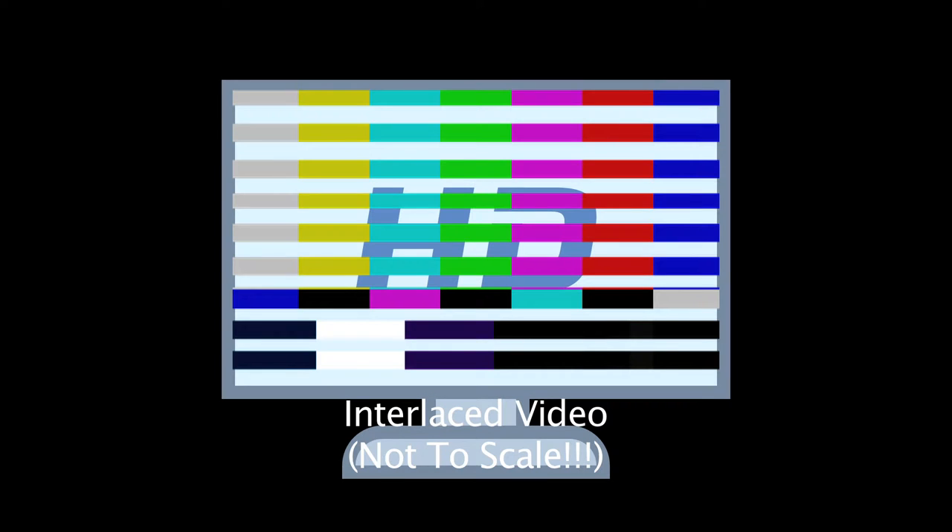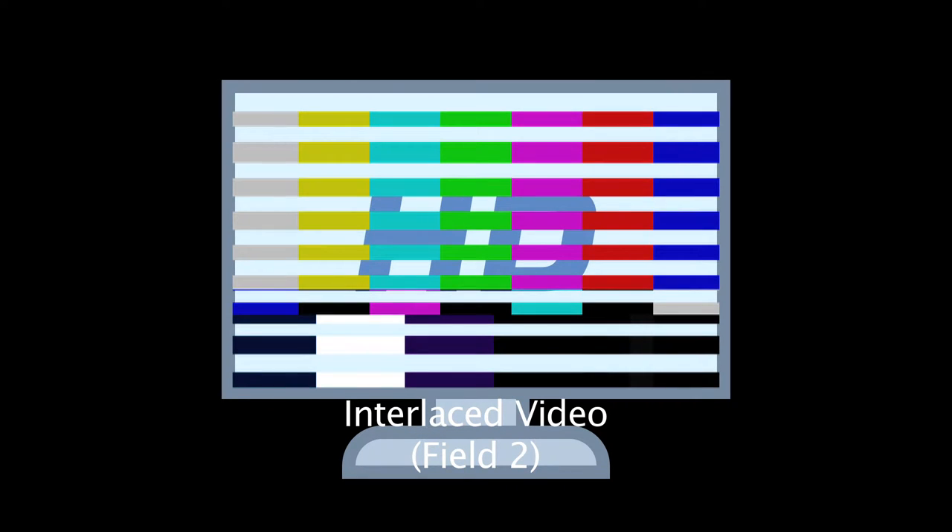The signal your television displays is either interlaced — comprised of two separate fields — or progressive, which is a single field. Interlaced video signals use two fields to create one single frame; the purpose is to save bandwidth during the actual broadcast. Progressive video is comprised of a single frame broadcast at once. While both types of video signals use a line-by-line refresh, the speed at which HDTVs refresh — even for an interlaced signal — is too fast for the light sensor in the Zapper. Regardless of your region, console, or light gun, that technology was marketable to a mass audience because of the CRT's consistency.